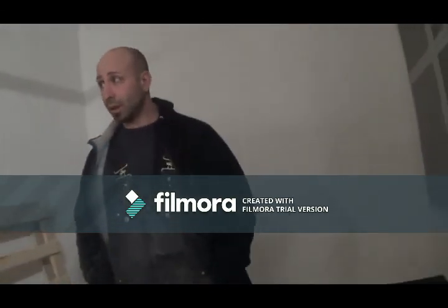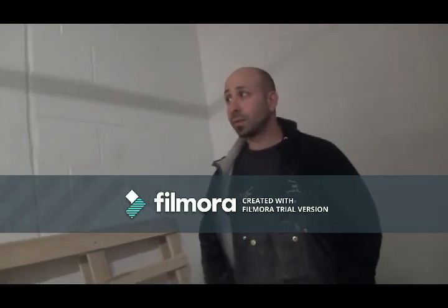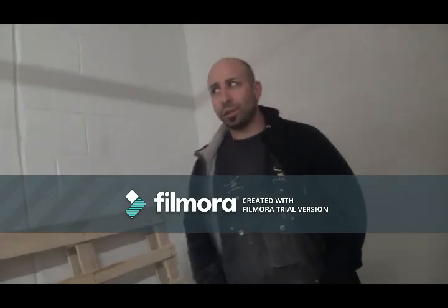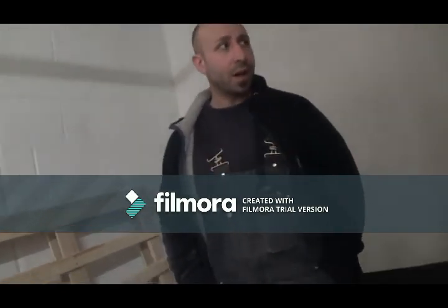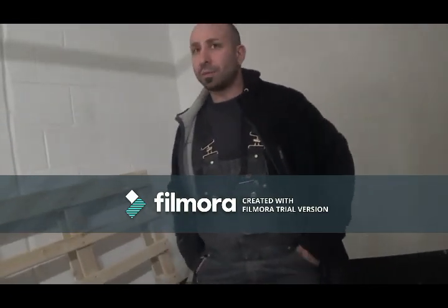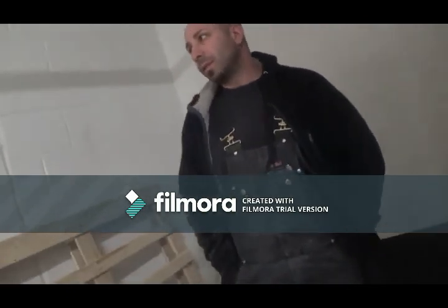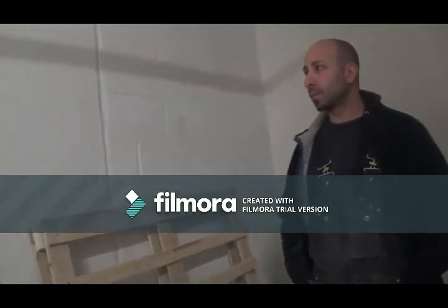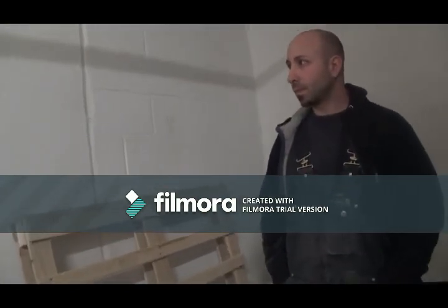Okay. I have a quick question. The dampers. The gravity dampers? Yes. The gravity dampers. Are they meant to be lubricated or not? They probably should be. I've been to jobs where they needed lubrication, right? But it's not really part of the maintenance package. I've been to a lot of jobs where they never get lubed, and they work all the time, right? No, I'm just making sure you're saying it so that we all can hear it, right? Because they're just a piece of metal sitting in a bushing.